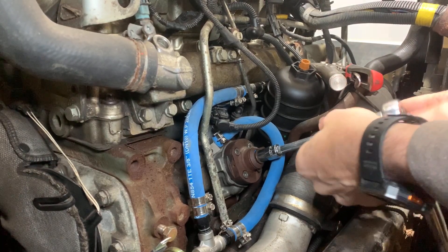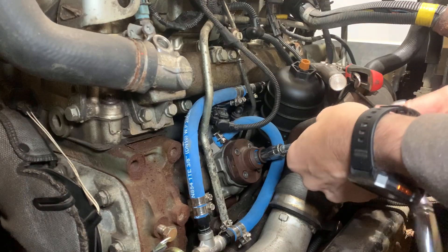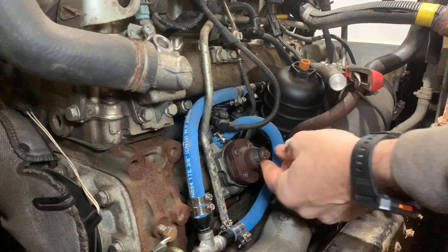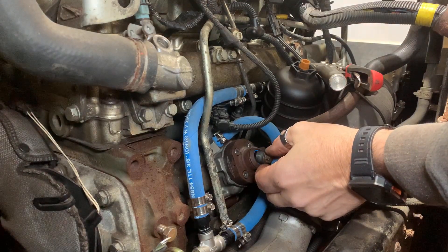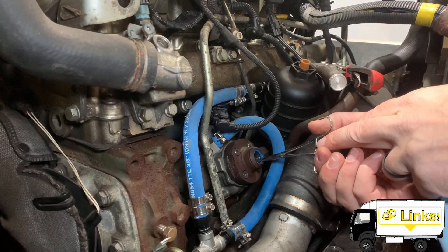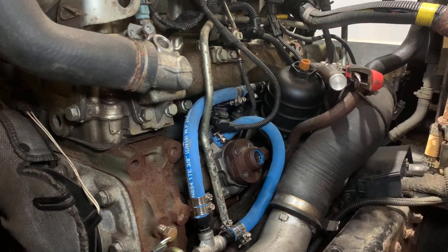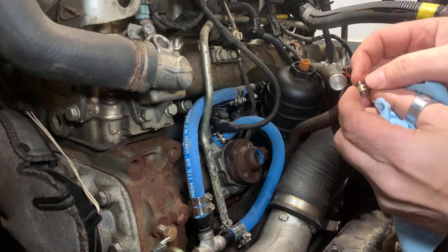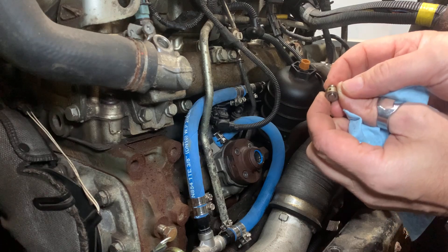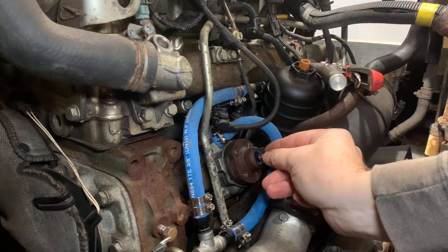I do expect we're going to see fuel coming out here, but if we don't, I won't be surprised. Be very careful underneath here. Fuel delivery valve. I can hear air going in and I can hear fuel coming out. Fuel delivery valve is most easily taken out with a pair of these clamps. Whether it was there before or not, we have fuel at the top of the pumping element. That means now we should not have an airlock if we did before. This delivery valve just pops open and closed — with fuel underneath it, there's fuel at the pumping element.